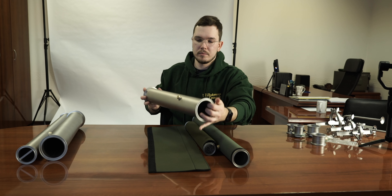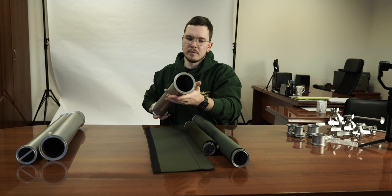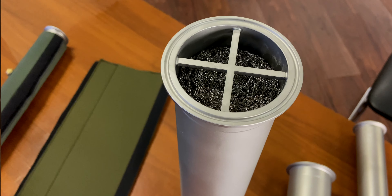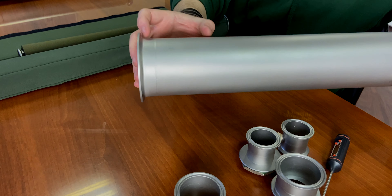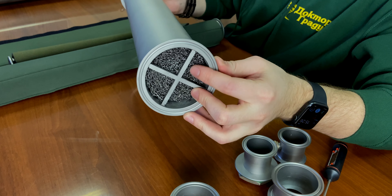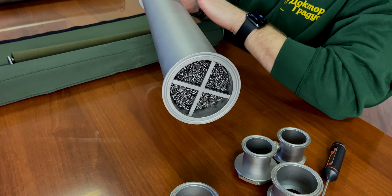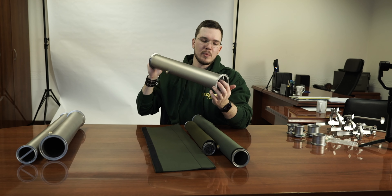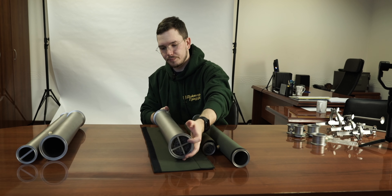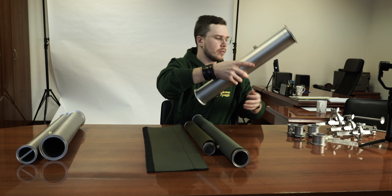This big three-inch extension can hold a lot of stainless steel SPP inside. Due to the weight, it needs a stopper. We have one stainless steel mesh — pretty big — just to distribute the vapor evenly and hold the packing inside the extension. You can also see there is a cross, which acts as a stopper so the whole weight won't push the stainless steel mesh down into the boiler. That's why we install this cross, which is also made from stainless steel.